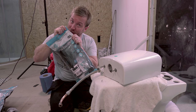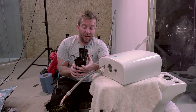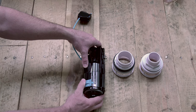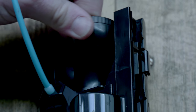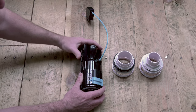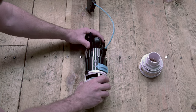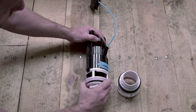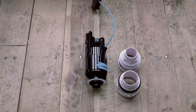So we're just going to pop it open now. We've got our standard buttons, and the main unit here. The Skylo has three miniature gauge systems to get your head around. The one we're looking at here is the gauge for the full flush, and the other side is the gauge for the half flush. We've also got an integral overflow built in that you can twist to open, adjust the height according to your cistern, and then twist to lock in position. After that, we've got two connection plates for the bottom of the cistern — one that's two inch and one that's inch and a half — and they're really easy to change over. It also demonstrates how easy it is to change the flush unit for servicing once it's installed. There's a poll appearing asking if you want a video on how to fully calibrate your full and half flush on a push button unit — please take the time to answer that.